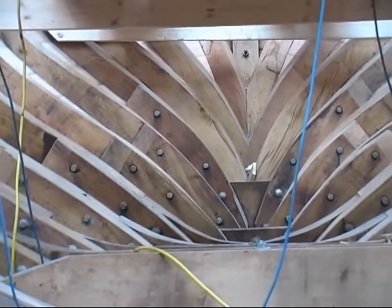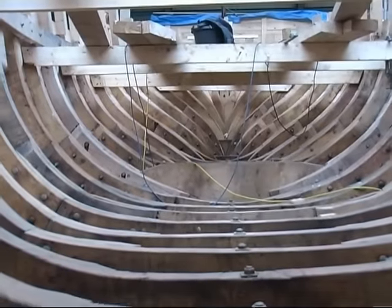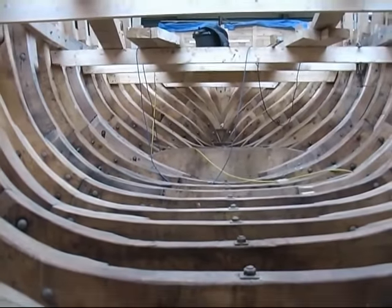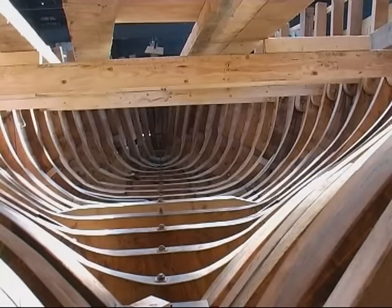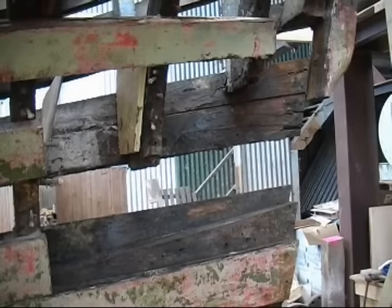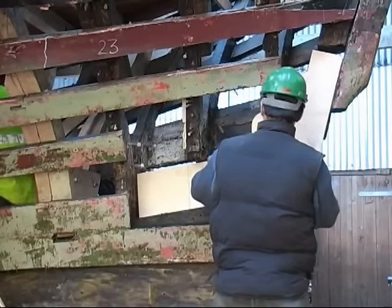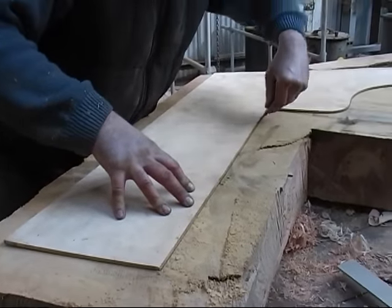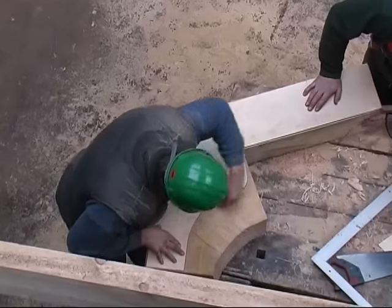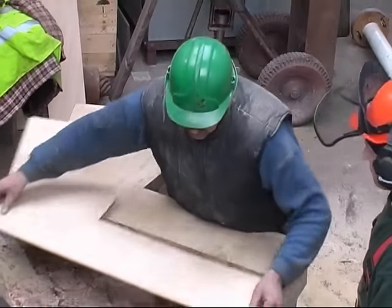The restoration of Barnabas required the replacement of over 160 individual pieces of framework. During the framework restoration, replacement work is carried out on the stern with a fitting of a new knee over the deadwood. This is shaped from a substantial piece of oak heartwood.